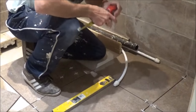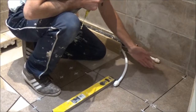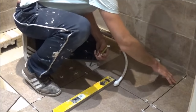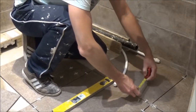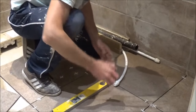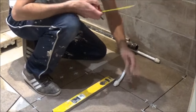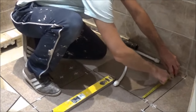By doing this, if you've got an angle that isn't at 90 degrees and say you're cutting and it's tapering back towards this way, you'll make sure that the cut edge is the taper. Don't make the mistake of measuring from this edge to there, doing the cut, and then realising when you spin it round it's wrong. So you always measure from the clean edge of your tile out and put your mark.